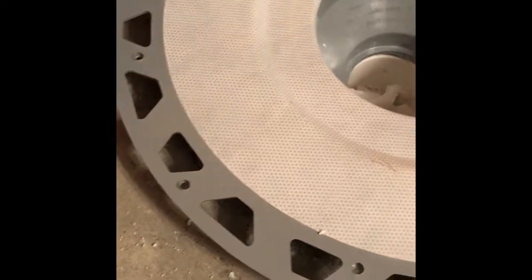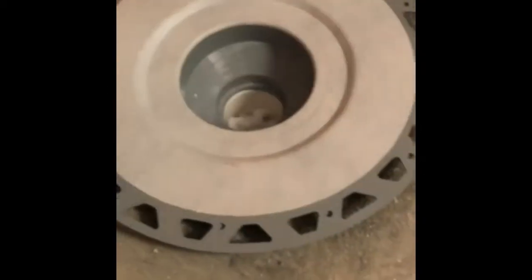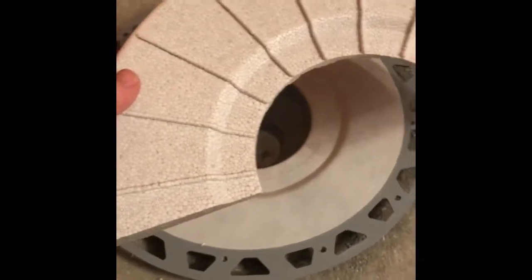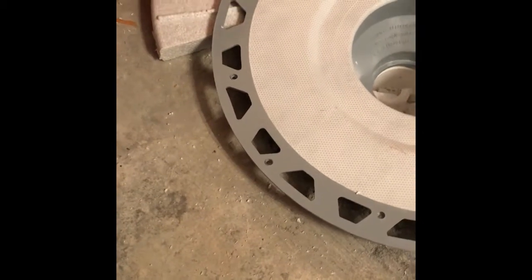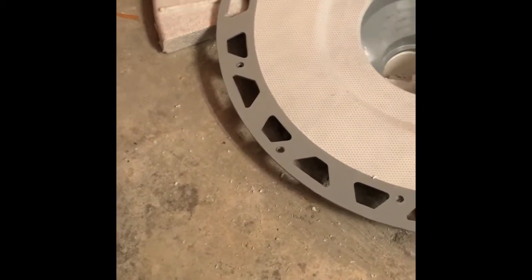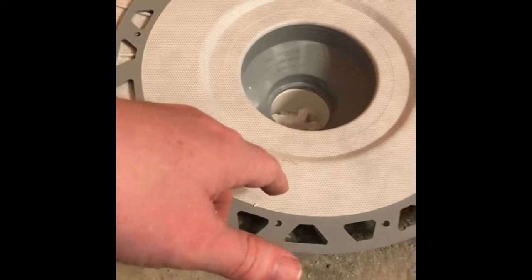The drain just barely slides in and out, which is good. I could back-butter my foam on the bottom, apply a good amount on the top to create a bond between these layers. Obviously watch Schluter's videos to make sure you're familiar with this. My plan is there's going to be thinset on the floor and thinset on top of the foam, and then this is going to slide underneath with its sister half going in the other side as well.